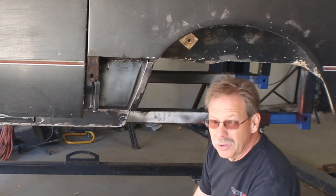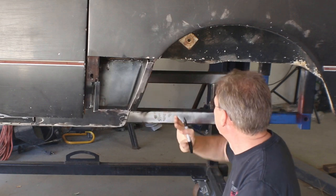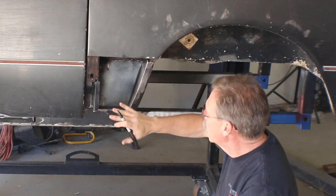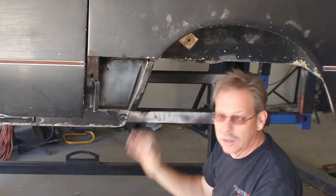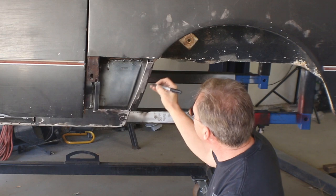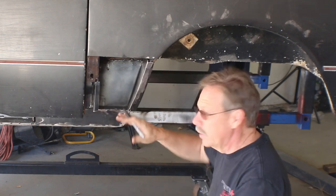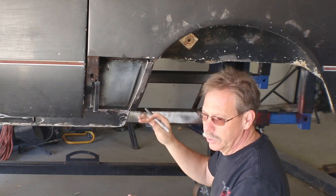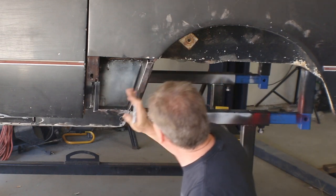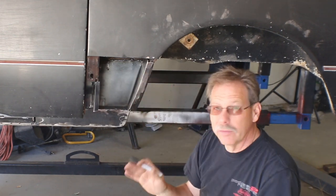So I think what I'm gonna do is, since I know I need to adjust this anyway, and I'm gonna end up working on the other side again anyhow. But I need to adjust this by about the 3/8 of an inch, no matter what. And that was just an error on my part. We had very little metal here to make patterns from to rebuild. And then I think I just kind of got some angles off, and it's not very hard to fix.